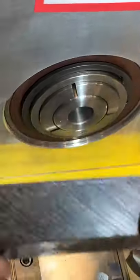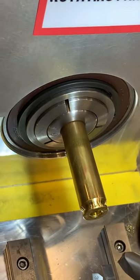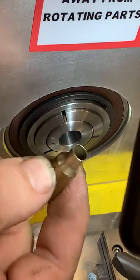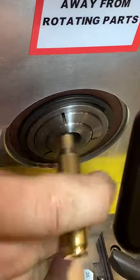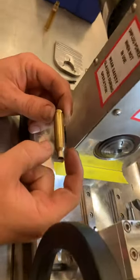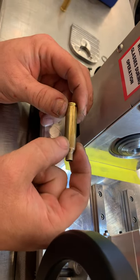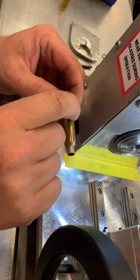You can also test to make sure your fit is good: put the case in backwards and it should go in about the same amount that it hangs out. You can see where my fingernail is — that's as far as it goes in. That's telling you the taper is contacting here on the shoulder-to-body and holding it there.